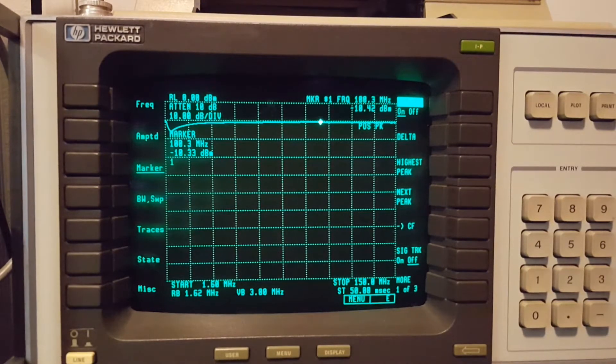It's about half a dB low for the most part across 150 MHz of spectrum, which I guess isn't all that bad. We've got loss in the connectors and stuff, so I think the 0.15 dB insertion loss specification might be cherry-picking a certain frequency. So I'll just go on to the next one.